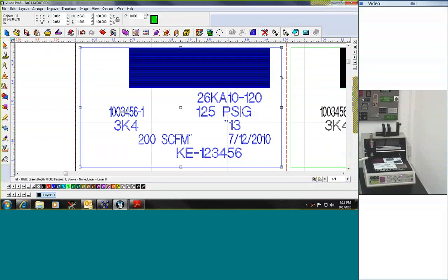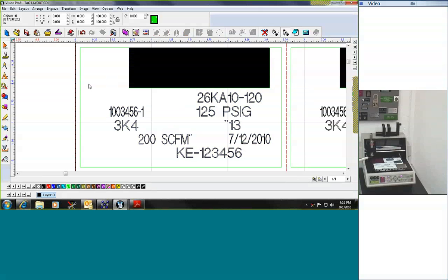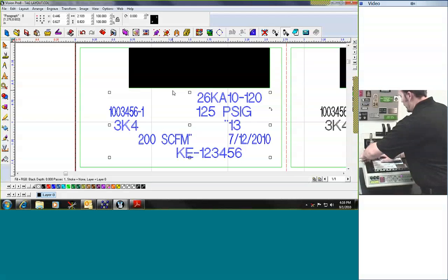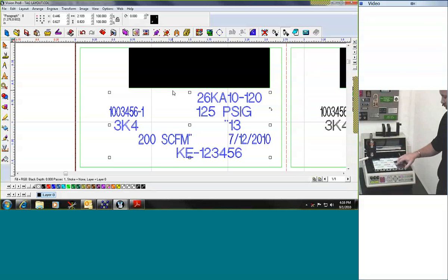Keep in mind this is an actual representation of where the engraving is going to go, and if you remember we had that scanned image behind it, so the location of this information sits on top of those text boxes. We're going to select the alphanumeric information we want to engrave. Coming over to the machine, I'm going to set it up and place my blank tag in the upper left-hand corner. We're utilizing a material called multi-mat, which is a two-sided tacky mat that holds the tag in place. We put the multi-mat onto the table, push it down a little bit, and that's what's going to hold our tag.